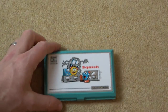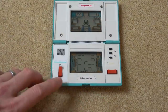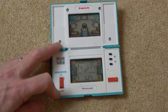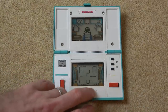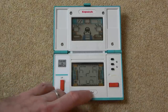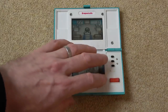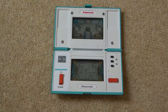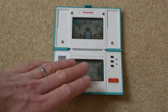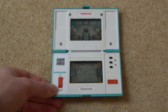So, yeah, I can fully see why people collect these. I would definitely be up for getting another one. I might keep my eye out for them. I like the fact that that was, to me, an interesting fault, because it wasn't just cleaning the buttons. It was an actual fault with the trace and then having to kind of pinpoint it. And then even after the repair, the fact it didn't move up and down, it did the same thing because it was joined there. So I was checking for continuity. I didn't think to check for a short between the tracks. It was also interesting to see the way they did it. So a printed circuit board, and then it was overlaid on top of it. It's something I don't think I've seen that before, but it's probably very, very common.